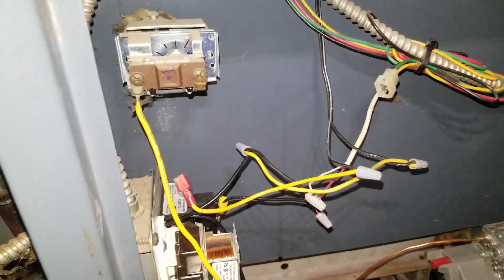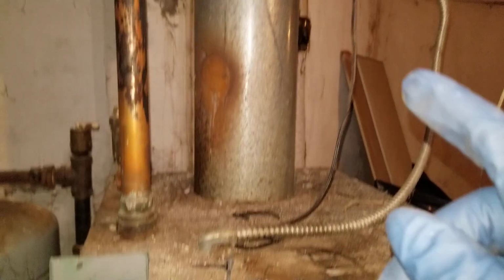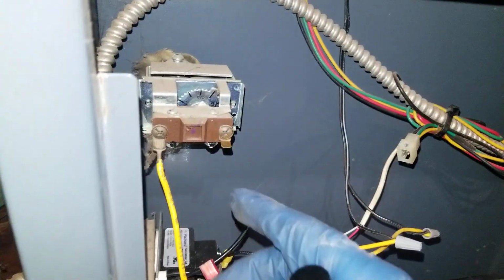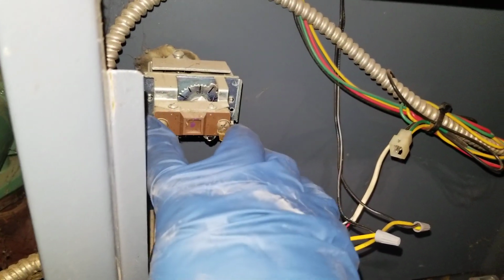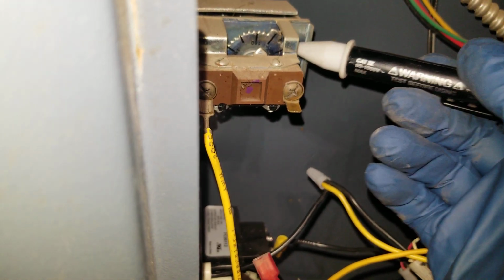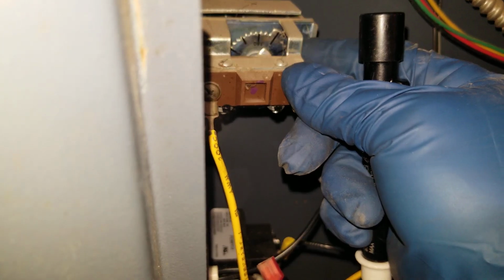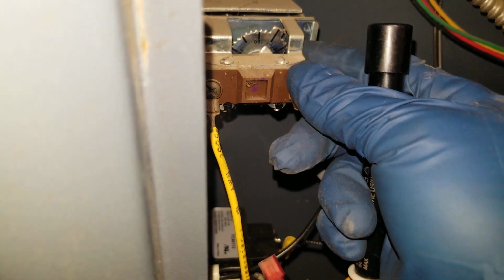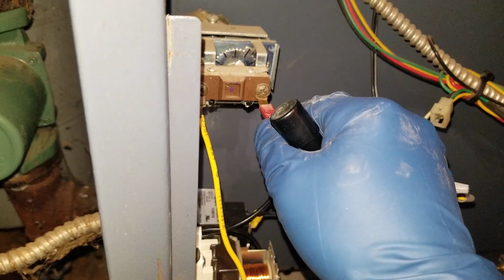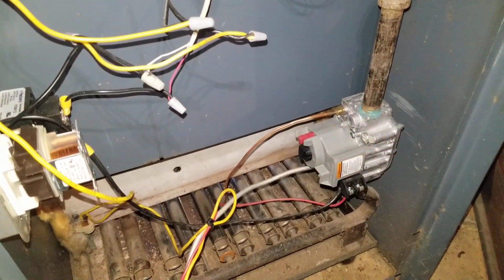Now the boiler control is not difficult at all. It just goes through switch number 1. The damper also has a switch if this was connected. Then the aquastat is just a piece of switch, nothing else. It has its setting set to 180, and this can be set slightly more, slightly less, but roughly 180 right there. And if there is a call for heat and the aquastat has not reached 180, then that turns on the gas valve.